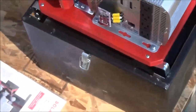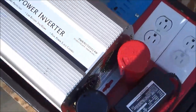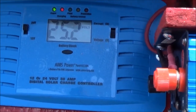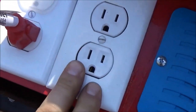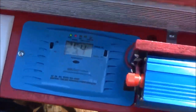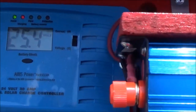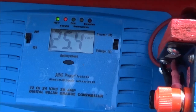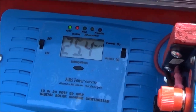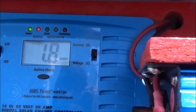Next I want to show you it's charging the batteries off the solar. The solar uses standard duplex receptacles and a 50-foot cord hooked to standard MC4 connectors — the solar connector. It's all plug-and-play: just plug your solar panel into the cord. They're male and female so you can't get them backwards — polarities are fixed, you can't mess that up. We were at 25 volts and we're up to 25.4 volts at 4:30 in the afternoon, charging away on a partially shaded panel, putting a couple amps into the battery.